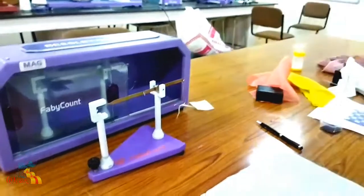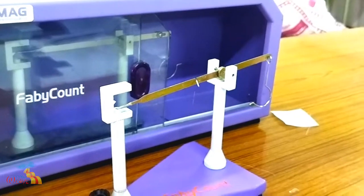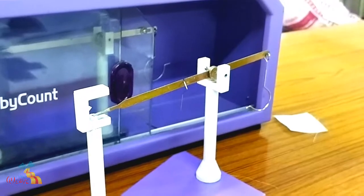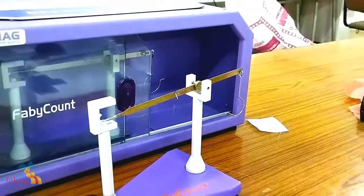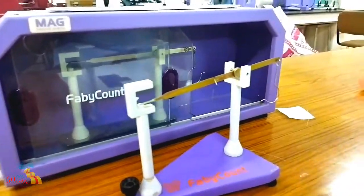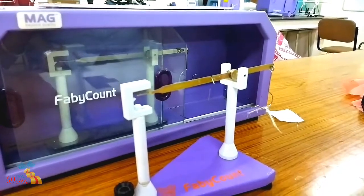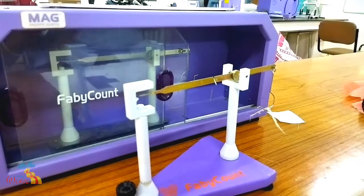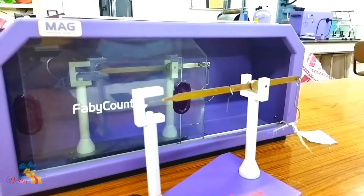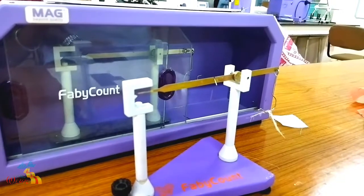You can identify - this is not the end point. Again you have to take two or three yarn from there. Until, like a physical balance, you have to make it so that one or two yarn again - now it is coincident, now it is coincident with the fixed pointer. Now this is the end point of your count, that is the weft count you have found.